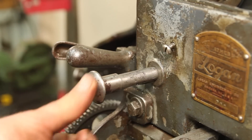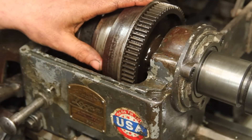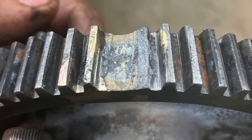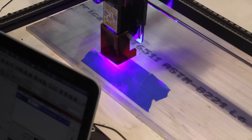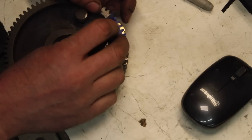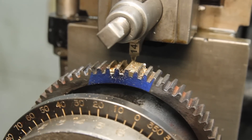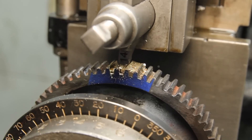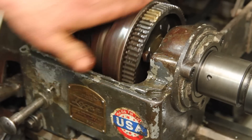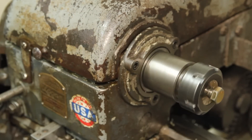Final result — now I don't need vise grips on there anymore. I've got all this back together for the second time; the first time one of my braze jobs failed almost immediately. I kind of suspected it might be bad but I just brazed it up again. This time I also cut a piece of masking tape to serve as a little visual guide, and that really helped make sure things stayed on track as I was cutting. I did previously try directly marking on the gear but it doesn't mark the braze and I couldn't get it lined up quite right. I've been running it in a little bit and it's still a little noisy, but as it runs in more it should get better.